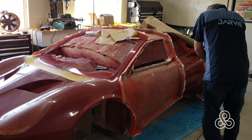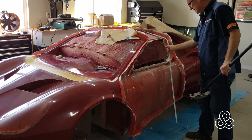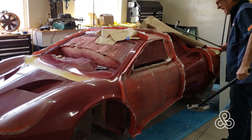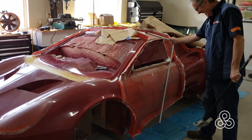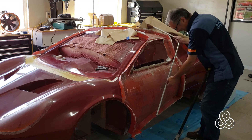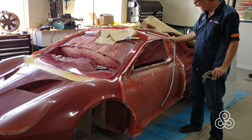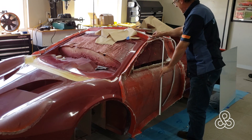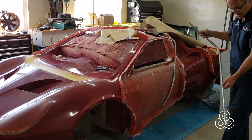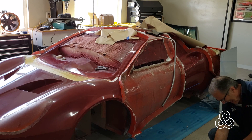That method of bracing is going to be with some pipes. Rather than drag the hydraulic bender out — this mold doesn't have to be that strong — we're just going to use some electrical metal conduit so you can just use a hand bender. It might not seem like it would be strong enough, but once we have a couple of pieces of pipe and the strength of the fiberglass mold itself working in conjunction, it certainly makes a mold that won't flex enough to prevent us from getting parts out that are all straight to a line.